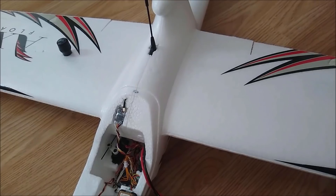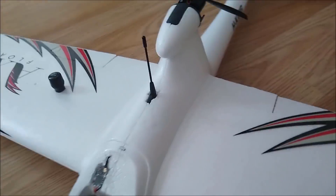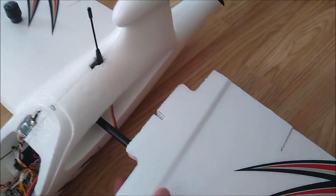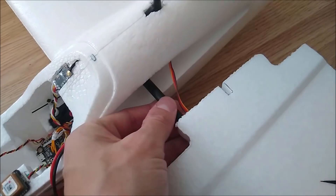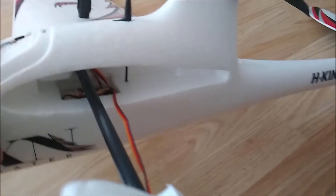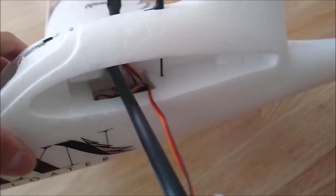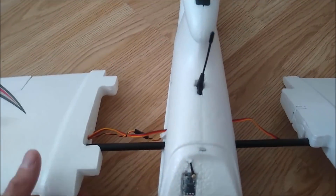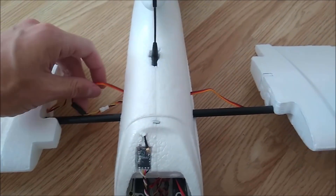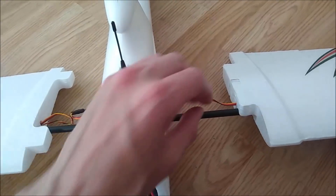The wings on the AXN, unlike the Big Slayer, are not actually screwed in place — it's literally just a friction fit. On this wing I've actually cut a little slot, because if you look inside you can see the Crossfire antenna running down through the fuselage, so that little cutout is just to accommodate where the antenna goes. The wings are detachable, so the servo and video transmitter in this wing and the servo in the other wing are on plugs so they can be easily removed.